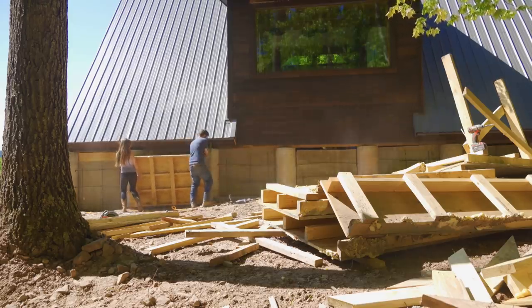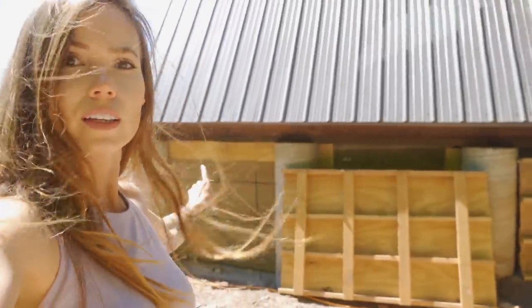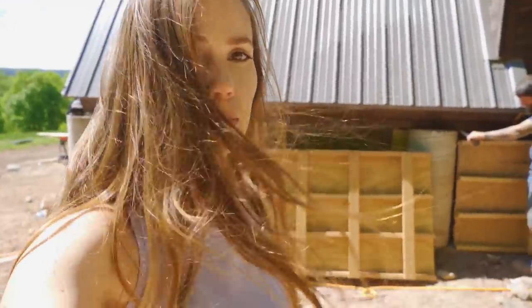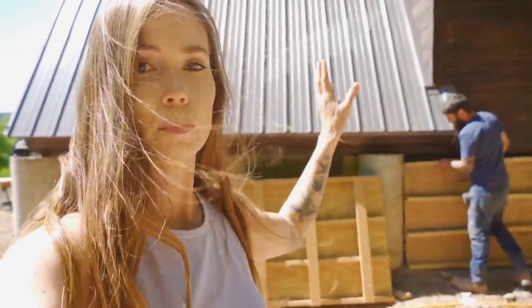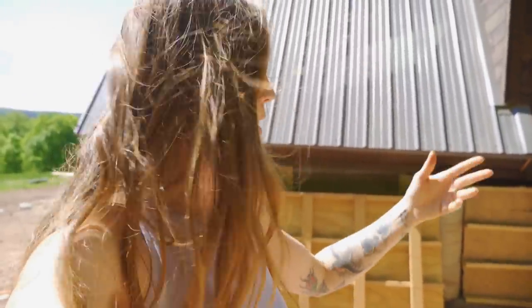All of the leftover forms that we have to reuse for the fronts are up in place. This one right here, of course, needs to be built from scratch because that's the one that blew out on the opposite side. So it needs to be completely redone, which isn't a big deal. These two that Josh is at fit perfectly. This one right here, we did not have a form for on the opposing side because that's that open space that you see by the Mr. Cool units where the front porch is going to come out. So there's going to be a deck over top of that. We're not going to close that in with concrete. You'll see what happens with that as we get to that point.